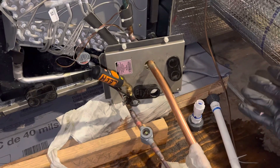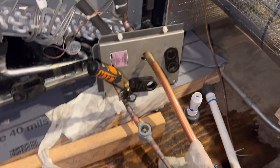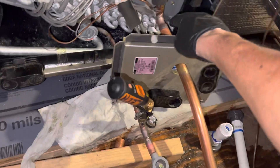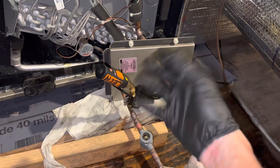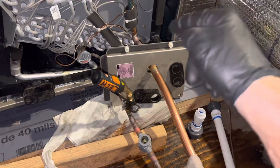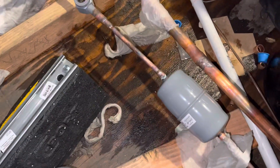They bring you that engine and head and say 'just throw a gasket on it and put it in my car' — no, I don't think so. So it turned into a bit more of a mess and cleanup. There was Stay Brite 8 on there before, so my son had to cut that out, because you don't heat up Stay Brite and then try to put silver brazing rod on it — it's a contaminant, it must be removed. He had to cut those out and hook up right to it with silver braze.